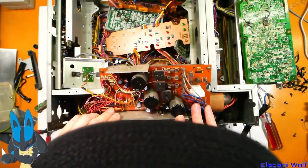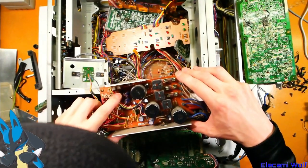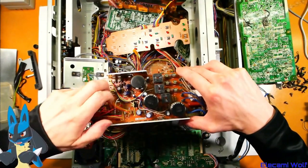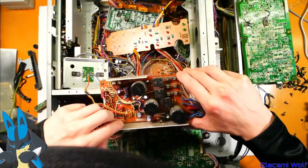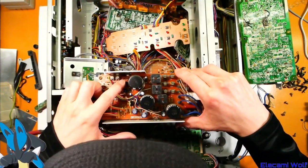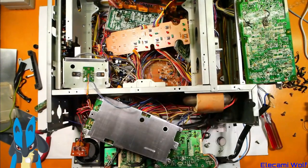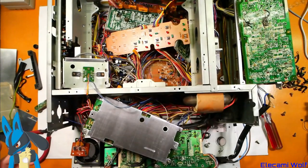So that's the power supply. The regulators use a Zener and a digital transistor — you can see that stuff down there with a Zener and a digital transistor. A lot of the leaking caps are making the board go dark. There are some full bridge rectifiers and I think that's us for the electrical stuff — we've explored all sides of this thing.